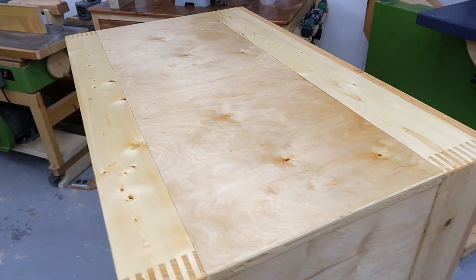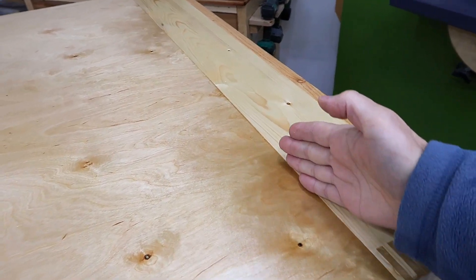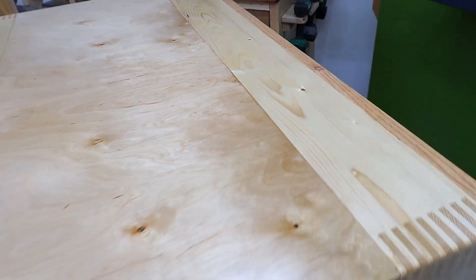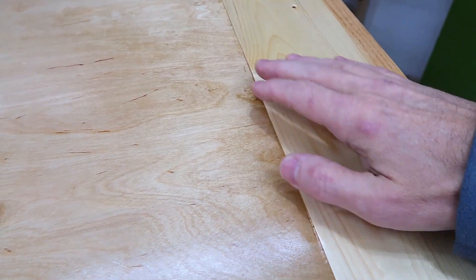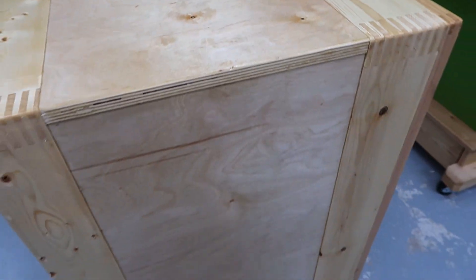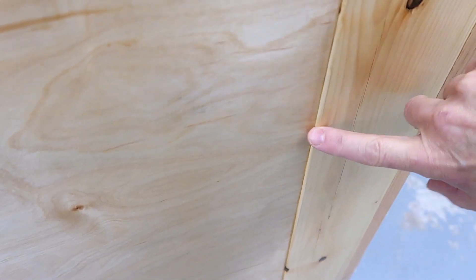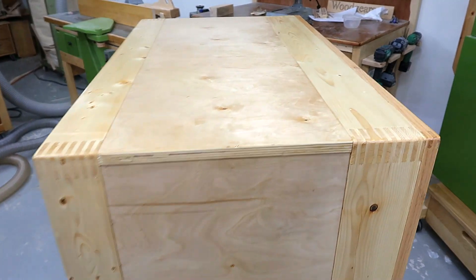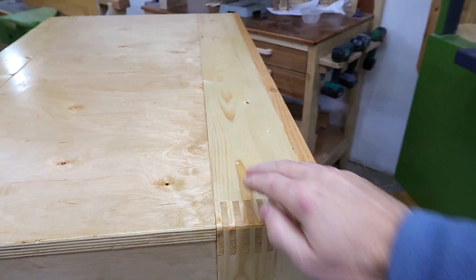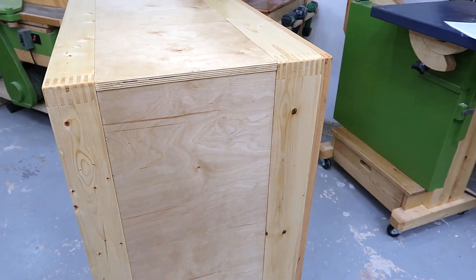Some screw-ups come from trying different things. What I hadn't tried before was putting a plywood panel between two solid members with no slot — just a butt joint glued with a few floating tenons. That worked out fairly well. Dropping the plywood down a little helps because you can sand it without worrying about sanding through the thin veneer. On the sides I inset the panel quite a bit further, which I should have done on top too, because it creates a natural edge that hides gaps. Any error in flatness between the two frames results in a gap since there's no means to adjust.